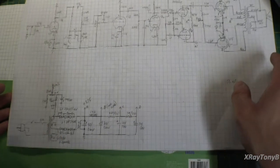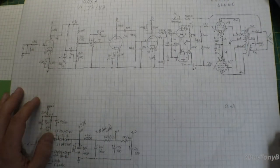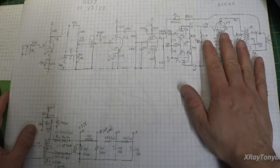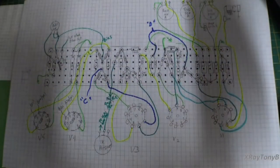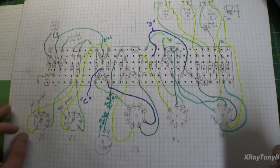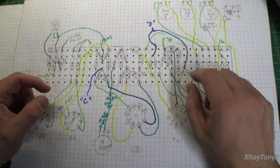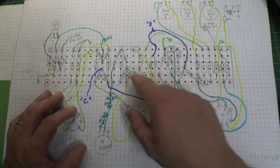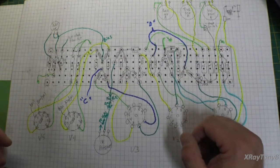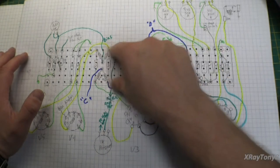This is a very basic circuit — pretty garden variety for Fender. So the next thing to do after you get your schematic laid out is to decide on a turret board. In case you've never seen a turret board, those are the kind of Formica boards with little standoff posts on them — used in a lot of the Fender and Marshall hand-wired amps, and even the McIntosh old MC-30s and so forth. They have turret board or peg board like this.